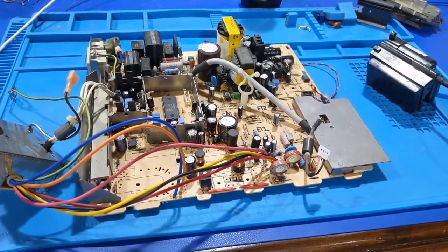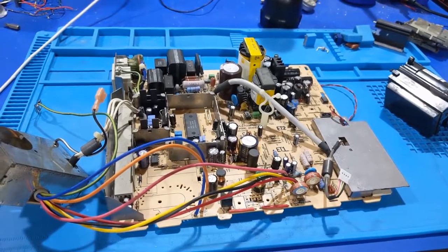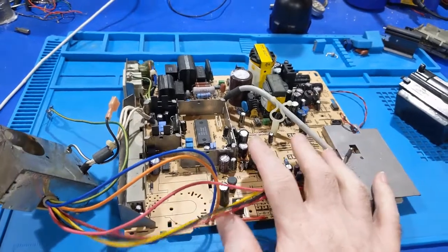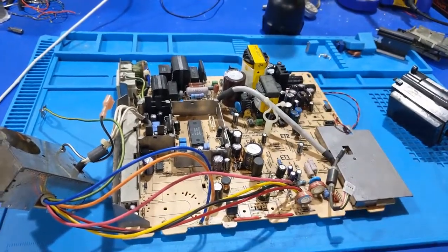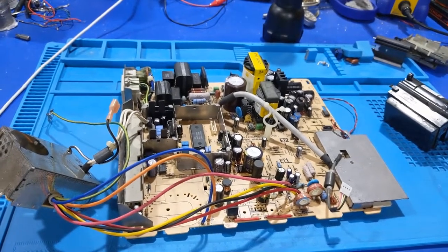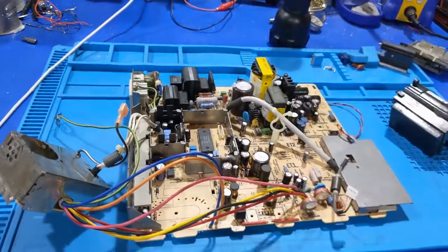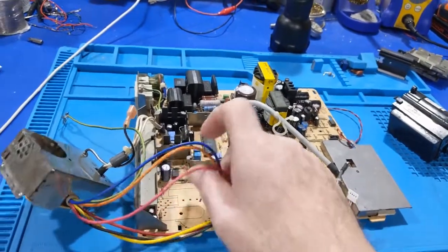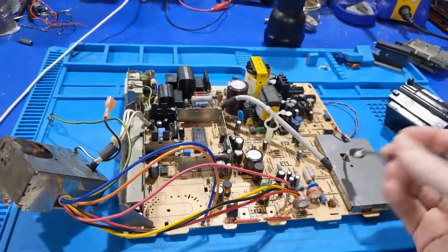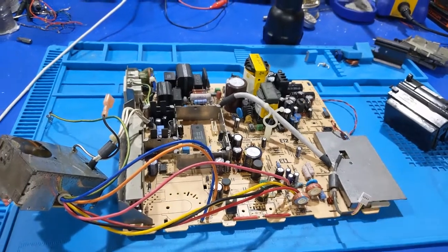So the 575 and 550 boards, the parts are interchangeable, and luckily the supply of those are somewhat easier to get than these because of two reasons. One, people ship these machines and they get smashed all to pieces, so they're junk anyways. And two, people steal the logic boards out of those to put them in the color classic. So that leaves plenty of analog boards behind. So we'll just use the analog boards as an organ donor to make this thing work again.